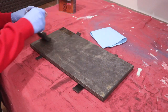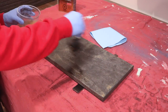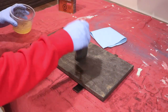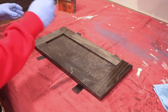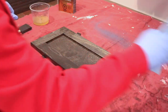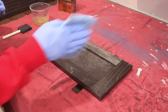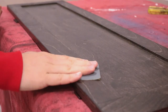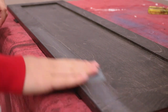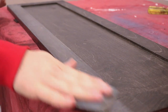To finish them, I applied 4 coats of wipe-on polyurethane. I applied the first 2 coats with a foam brush, then wiped off the excess with a clean rag. After the second coat was dry, I sanded each surface with 400 grit sandpaper by hand, then applied a light third coat with a rag. After the third coat was dry, I sanded with 1000 grit sandpaper before applying the fourth and final coat.